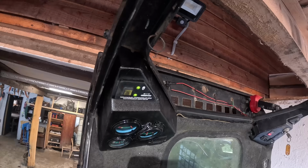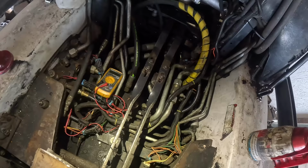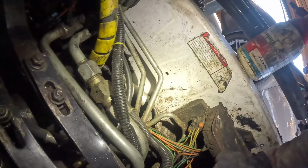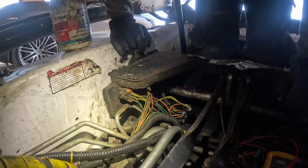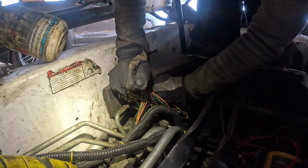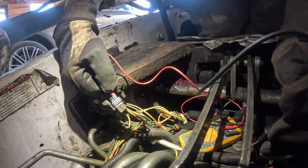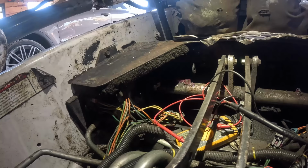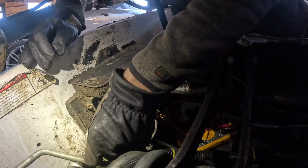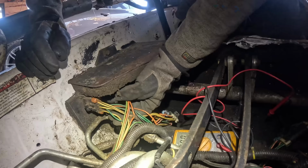Sort of. So you press those two down first. That signal is diverted into a power module or some type of a computer, which is that thing over there. I'm kind of thinking maybe this unit is bad. This thing, yeah, this doesn't work anymore. We got 11 volts there. Nothing there. So we only have one live here. Question is though, do we have any output? Anything at all? Nope. I have a feeling the fault is there.